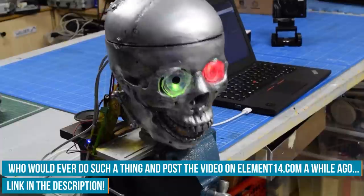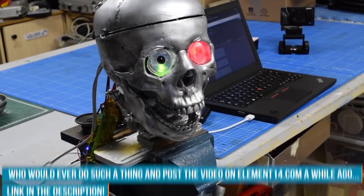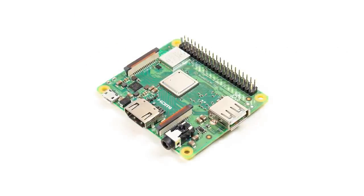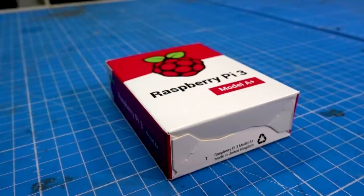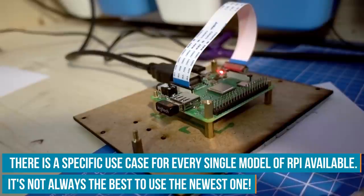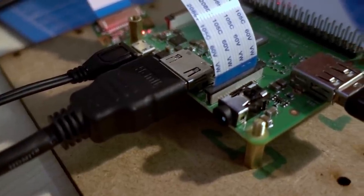We are building a useful robotic platform — not like Terminator heads with AI boards that get terrifying when they seem to freak out. This time we're building a sensible robot. I'm using the Raspberry Pi 3A Plus. The Pi 3A Plus has applications for certain use cases still better than newer modules. I couldn't get a Pi Compute Module in time, and I want to get familiar with the platform first. Also the 3A Plus uses a lot less power — it's not overpowered for my application like a Pi 4 would be — so I expect longer runtime and it has a smaller form factor.